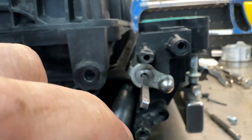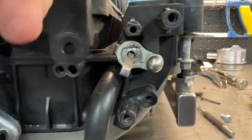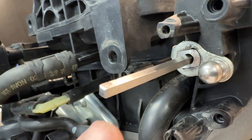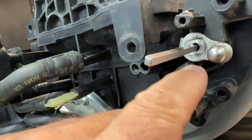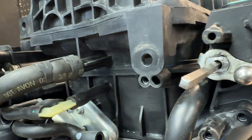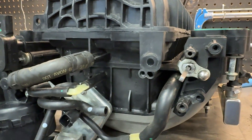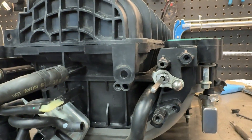Then I'm going to have to pull the whole thing out — maybe not all the way, but pull it out enough so the heat won't transfer and damage the plastic, and do my final weld on there. Also, I measured how far this key protruded past — it protruded 935 thousandths of an inch. Once I get this finally in there and in place, I'll cut it off at the right length with a zip wheel. Then I should be able to put my actuator and sensor on, and that should do it. This should technically be fixed, other than filling the hole on the other side.